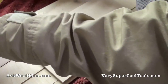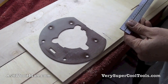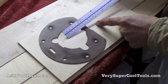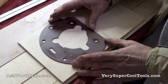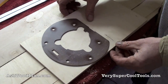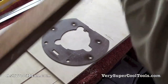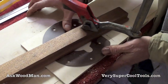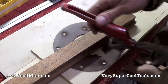I need to make a quick-and-dirty circle-cutting jig for the router. My circle is 16.9cm, so say 17 — that's eight and a half for the radius. I need to attach the base in this orientation off my Festool router. I've got a piece of quarter-inch Baltic, six-millimeter Baltic, and I'm just going to pin it down here with a clamp.